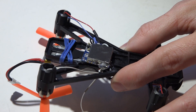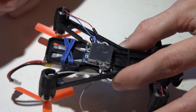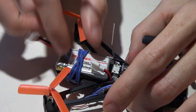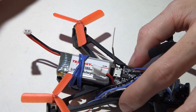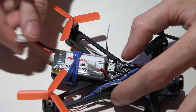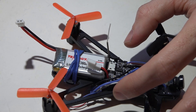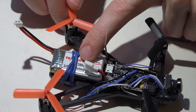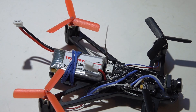I have just a drop of solder between channel three and the middle case, which puts your frequency somewhere around 5810 or 5808 — something like channel C5. As for the battery, I'm using a 380mAh. I'm not saying this battery is great or anything, it's just what I have. You can go smaller; I would actually recommend a 300mAh — that's probably your best bet.